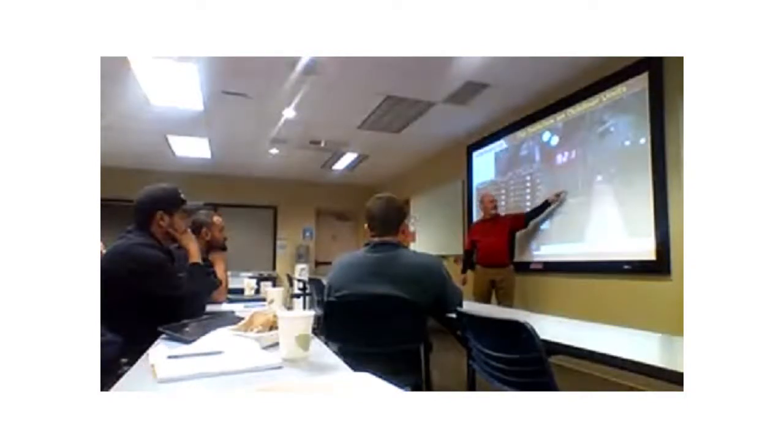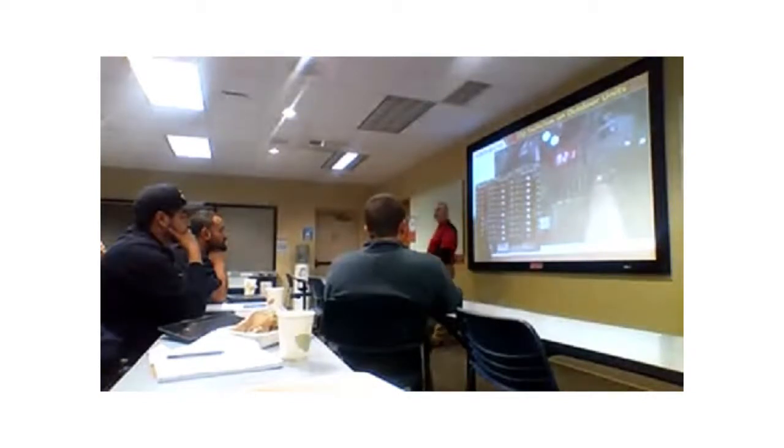SW5 sets the mode of the unit, physical size, BTU capacity. SW5-1, you can see in the red there, is turned on because the system has a central controller. It lets the outdoor unit know that the central controller is going to be making some command decisions. If you don't have that on, the outdoor unit doesn't know you have a central controller, and it may override the central controller for certain demand decisions.